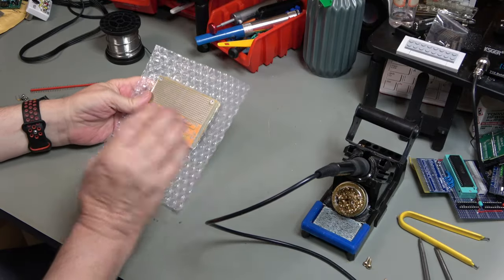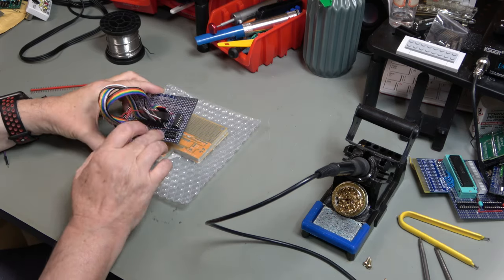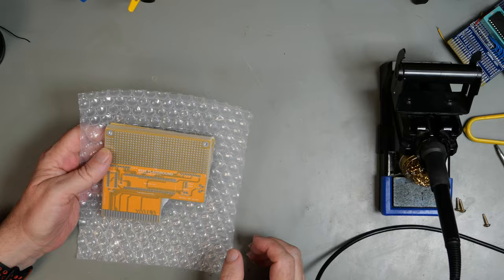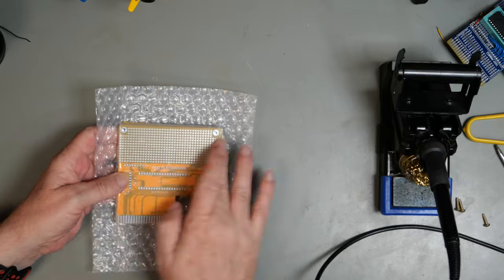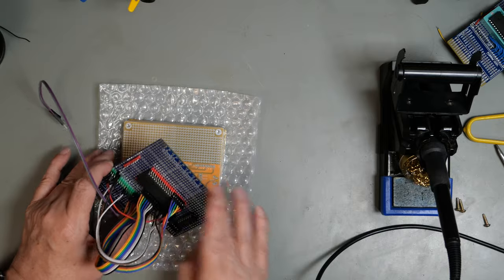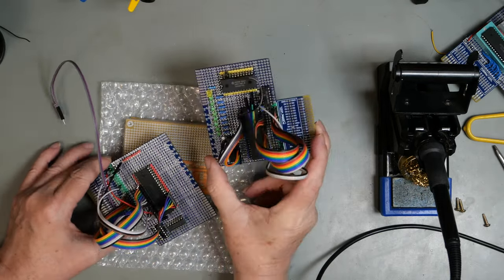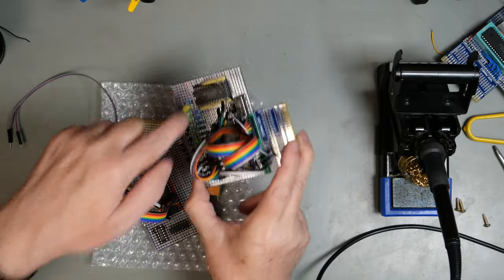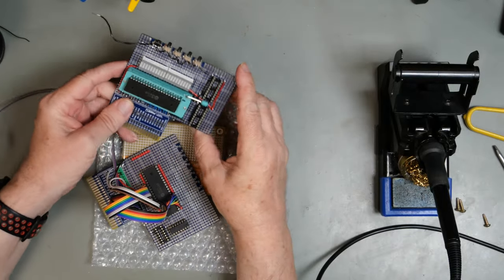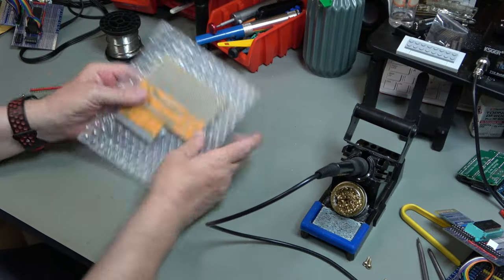These have just arrived, which is the PCB that I have built of this, and it has the 74LS74 flip-flop for clock shaping and stuff. I put a prototyping area on it, so that we're not constrained by what I sort of half decided to do on that. And with this one with the LEDs, it's got the RAM on it. This was our first one, and you can see I never even got as far as putting chips in those. Hopefully this is going to work, we shall see.